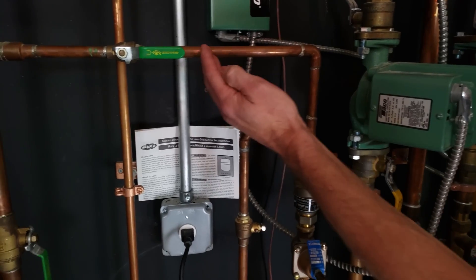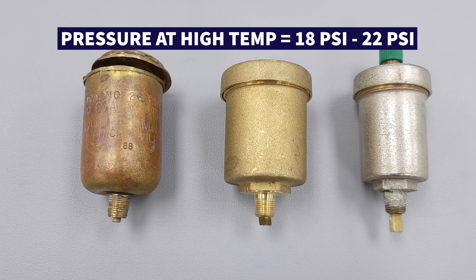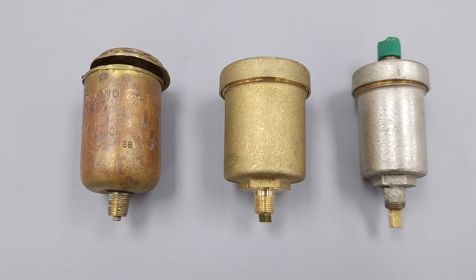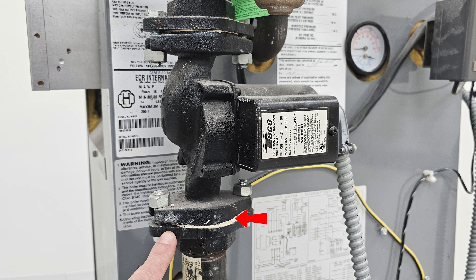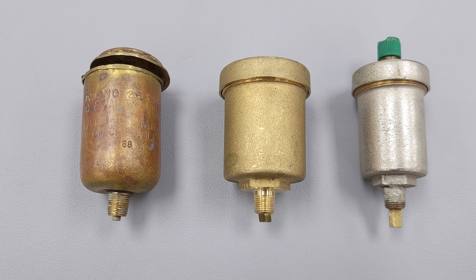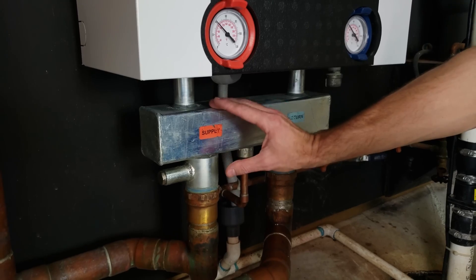Air may get into a hydronic boiler system even if you set the initial pressure at 12 to 14 psi when filling, and then it's maybe 18 to 22 psi at higher temperatures. Once the temperature gets higher or once the water makes contact with the heat exchanger, you're going to have micro bubbles forming — water is always going to carry a little bit of air. You could also have a leaky spot in a low pressure area pulling air in, or PEX piping without an oxygen barrier, or leftover air from the initial flushing when filling the boiler for the first time.